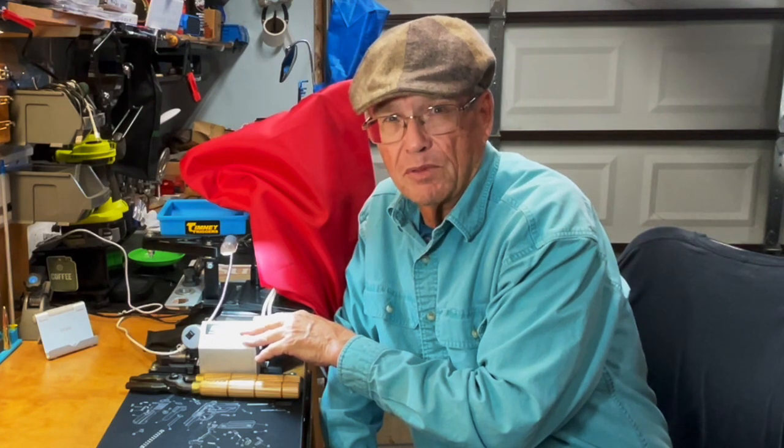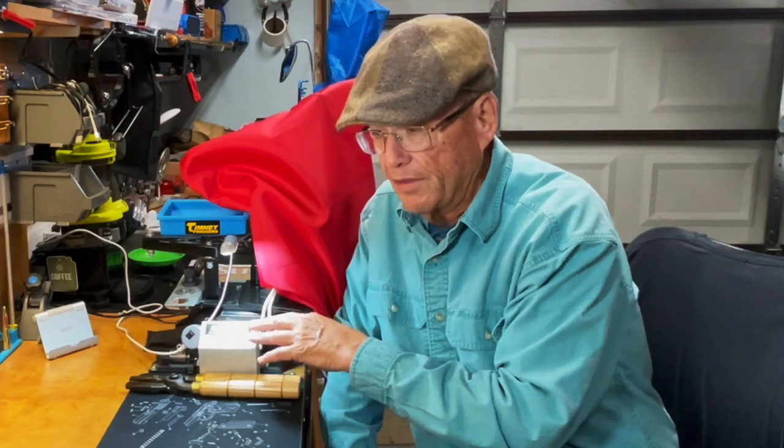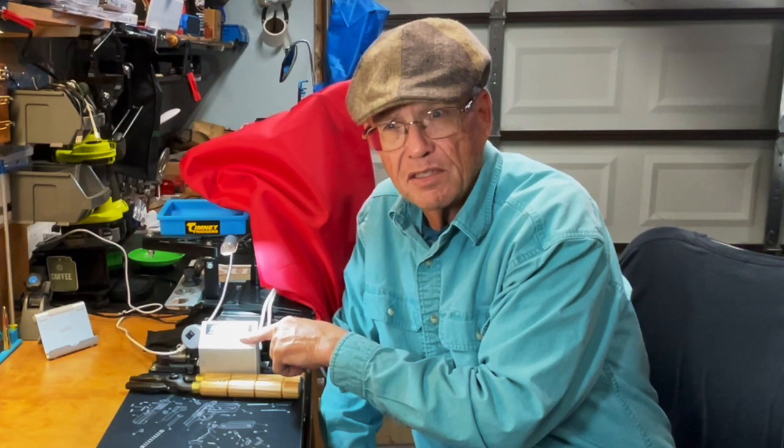I was real happy with the performance of the mold. The bullets look great. I got some loaded up with 3 different powders. We've shot lots of bullets in the 170 grain range out of the 40 Smith & Wesson, so we kind of knew what we were looking at as far as powder charges go. So I wanted to try some different powders with this particular one, so we tried some Vihtavuori N340, some Winchester 231, and some Power Pistol. Let's go take a look at how those rounds shot.